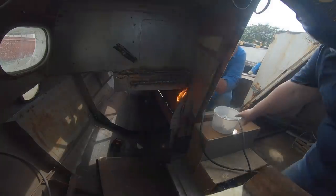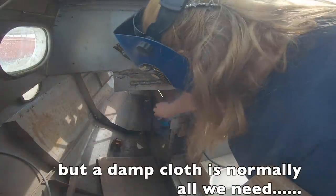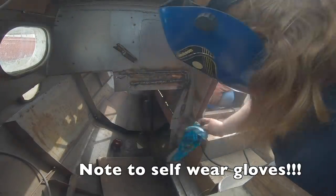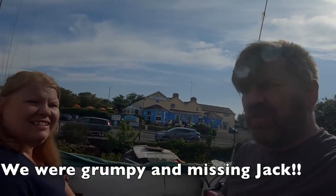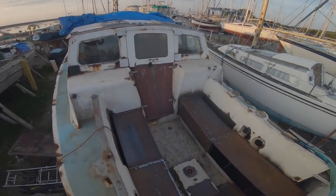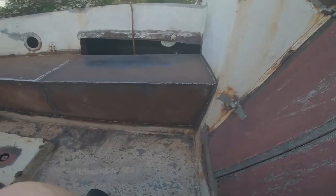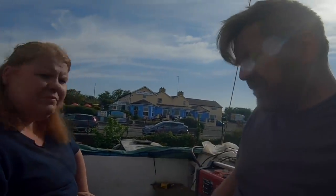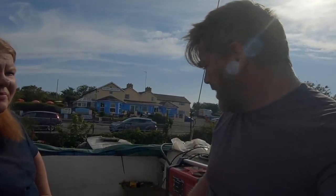All right, stop, we're on fire. I don't know what's happened this episode. We've not really done any talking to camera at all, but we've managed to get a seat front in that side, seat front in this side. We're now doing a seat front at the aft end of that side. We won't have enough steel to do the starboard side, unfortunately, not today. We won't have enough gas to seam weld them, but at least we're getting stuff tacked in place and then we can seam weld them next time.